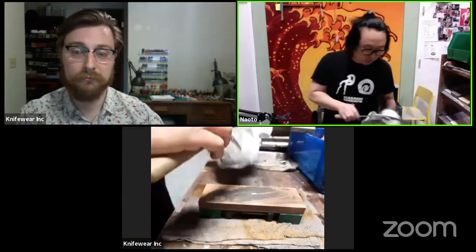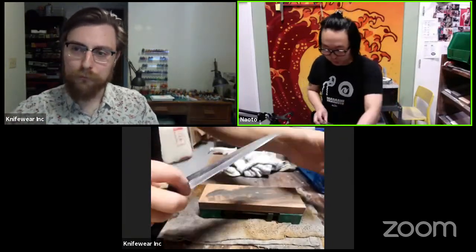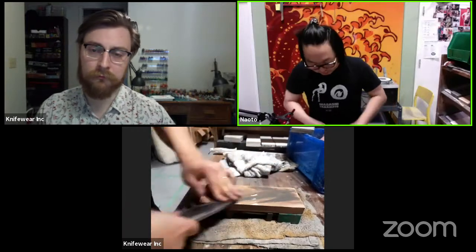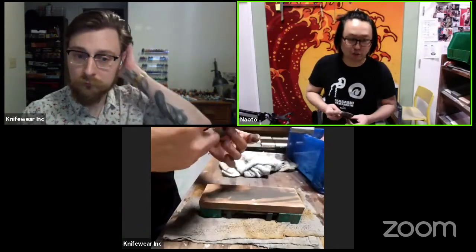Kyle Bolden just joined us, and he says, "Hi Naoto, this is exactly what I did to my petty from Minaka-san. I finally got the polish on the ATS-34, looking good too. Took an Ozuku stone to get that milky kind of graininess that he was looking for." Nice. With Ozuku, you have to find the right knife and the right bevel, the right type of steel, to get a really nice finish. It also depends on which layer of Ozuku it is. Some of the harder ones are a little bit hard to get to the finish, because as I said, they create a little bit more peaks. It's hard stone, right?